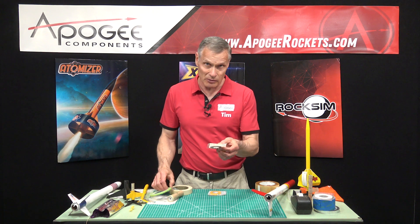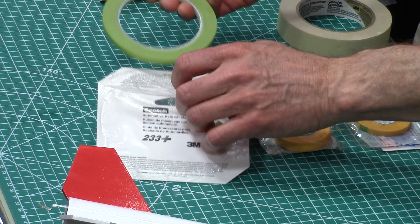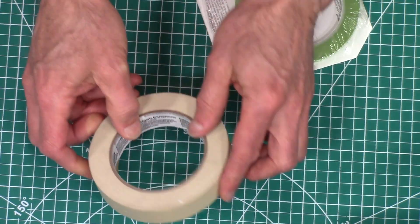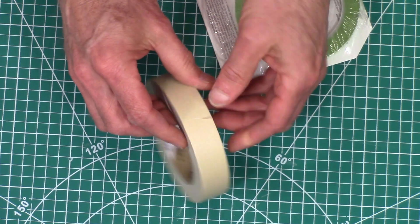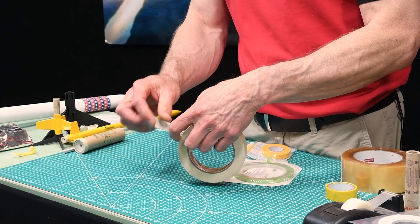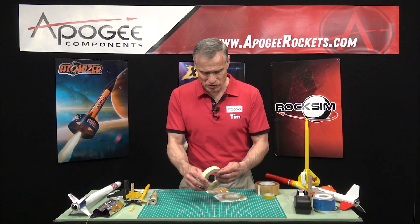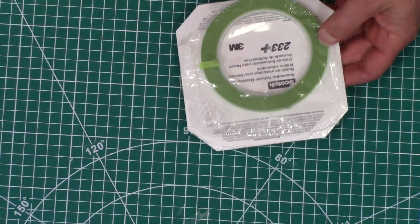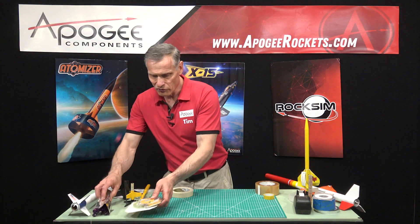Anything that I'm going to use for painting, I keep in the original packaging or in a plastic bag. When you take a roll of tape it's kind of sticky on the edges, and when you lay it down on any surface it's going to pick up dust. That makes the edges fuzzy, and then when you want to paint a nice straight line you're going to get fuzz on that edge. So keep the edges dust free by storing them in their packaging or a plastic bag.